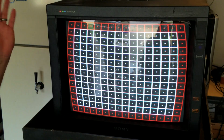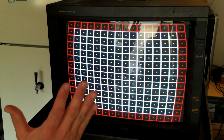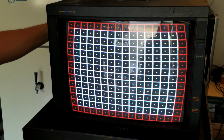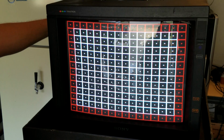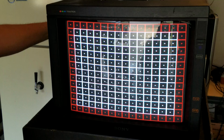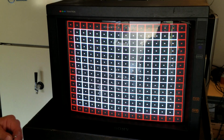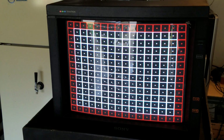It's really simple. It looks terrible, but honestly, that's just where the pin amp has gone too far and the outsides have started to go in on themselves, rounding the outside corners. As you put this thing in here, you can see that all you do is turn that pin amp and it straightens those corners out. You can go the opposite way and make it look the opposite, too much. But if you get it right in the middle, that really helps straighten out that line. That's just a note: when you see that, a lot of times that's all the adjustment you need to make to fix the corners.